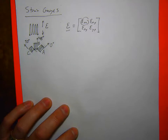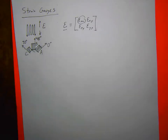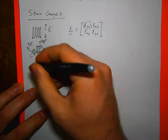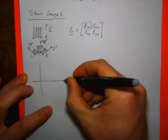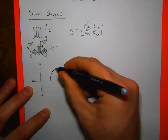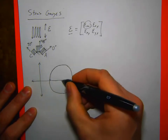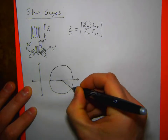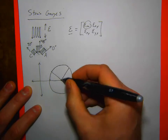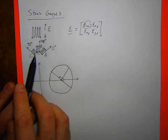The reason we have those three gauges is because we need them to fully fill out what is effectively our Mohr's strain circle. So let's go back to that Mohr's strain circle and throw some numbers and equations on there. For a 0, 45, 90 strain gauge, I can have one strain gauge oriented one way, another at 45 degrees — which in Mohr's circle is 90 degrees because this is a 2θ relationship — so 45 degrees relative to each other is 90 here.